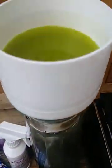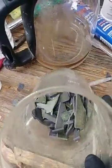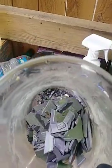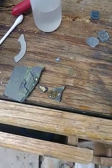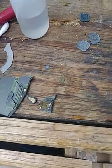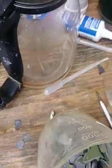We're still filtering the gunky stuff into the vessel. Looking at all of the CPUs - everything is dissolved, there's no metal left. I picked through the CPUs and noticed, underneath the silicon die on these two on the left, I picked the glass off and that's gold that did not get dissolved, not attacked by the acids. There's some silicon die on that piece still with gold - not bad for the whole bunch.